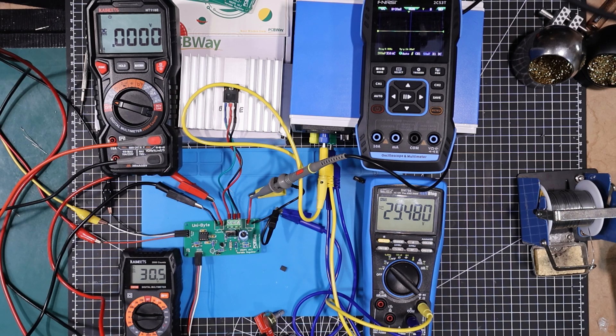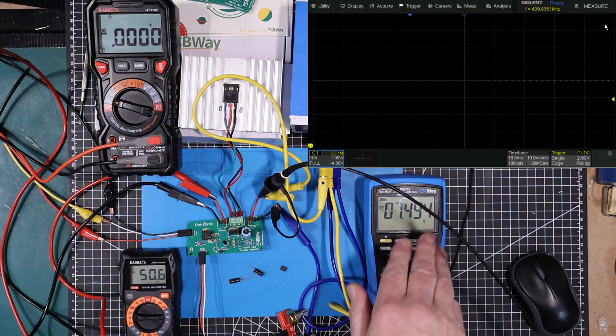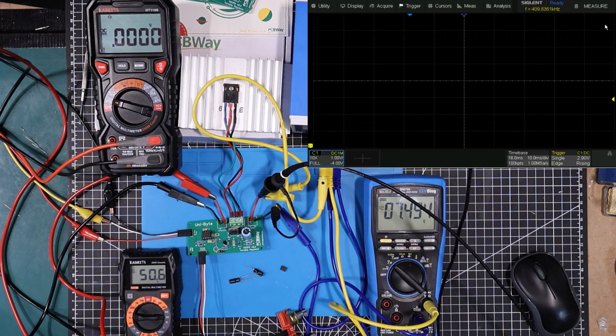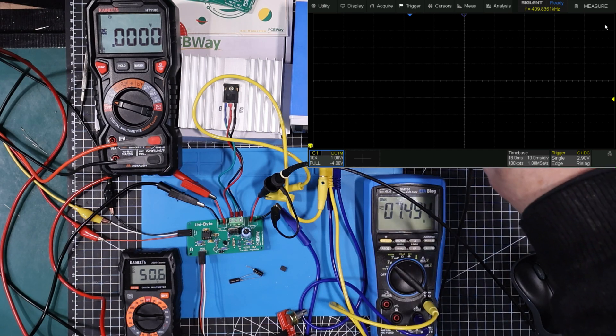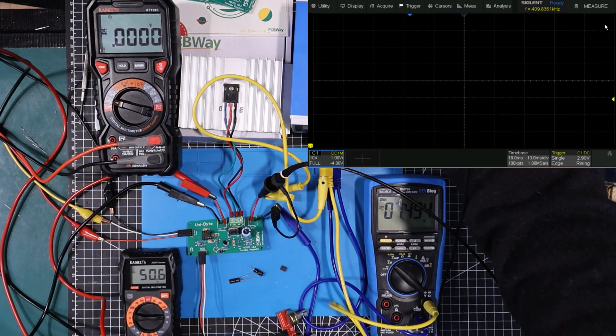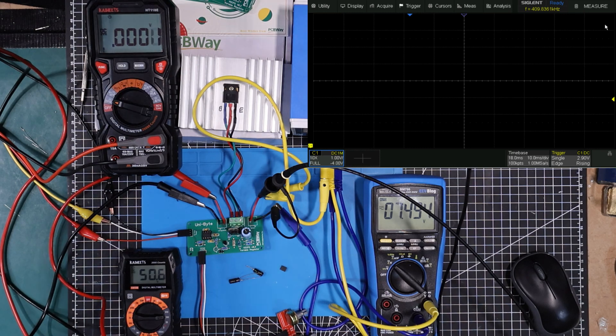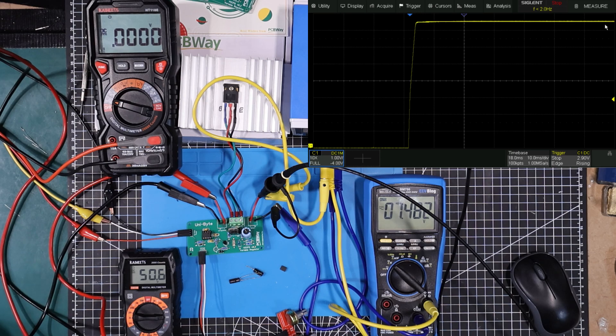What I want to do next is check how it looks when it's turned on under load. I've got the oscilloscope up and it's all turned on right now at about seven and a half volts — about one quarter of the way up its voltage range — with the load set up so at maximum voltage we'll be around 1.5 amps. I'm first going to turn it off and see if it creates any spike. It doesn't. And now let's turn it on and see how nicely it turns on. Well, that is pretty nice — very nice indeed.